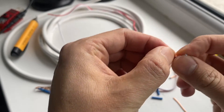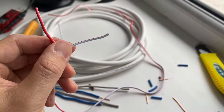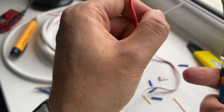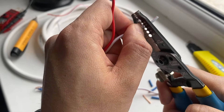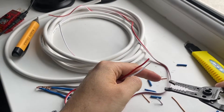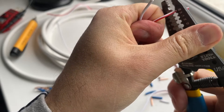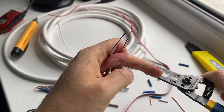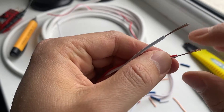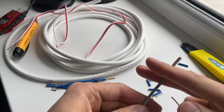When it comes to very tiny ones — this is number 20 gauge — most of the time it's low voltage, 16 or 18 volt wire. You may have it in your doorbell transformer or something like that. Same thing: I just strip it and remove the insulation. I would not recommend wiggling it because you can damage the wire while trying to remove the insulation. You just have to practice with chunks of wire like this because it's going to take some time and a little bit of practice.